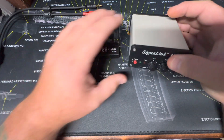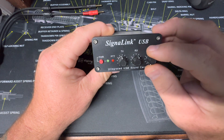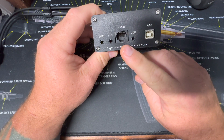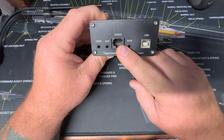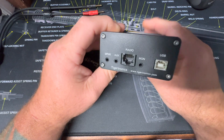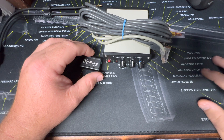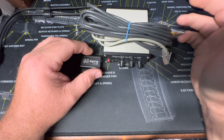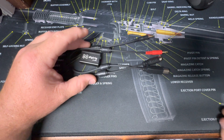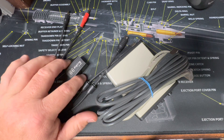I'm not joking — this isn't an empty case. So your Signal Link: you have your transmit audio knob, your receive audio knob, your delay knob, a power knob, indicators — and on the back you have to run radio control to the radio, USB to the computer, and you can still run external speakers if you want. That's everything — six feet of cable. Or... that. To me it's pretty self-explanatory — technology, we're moving forward, hallelujah.